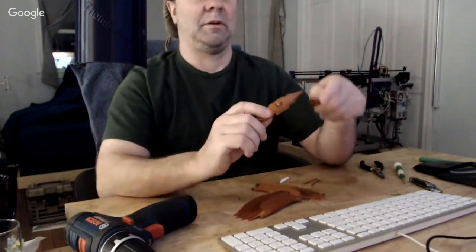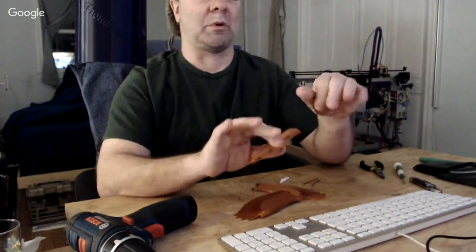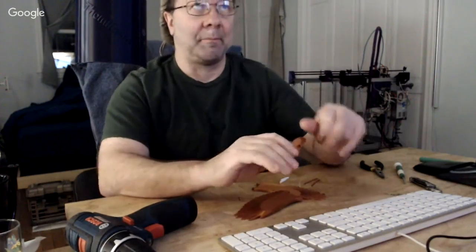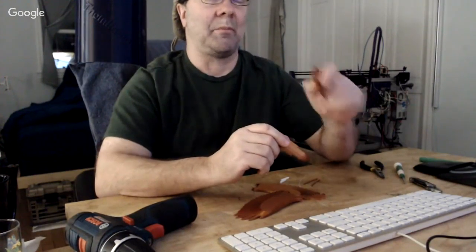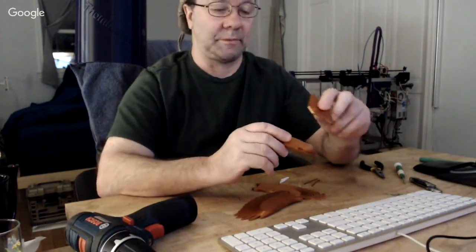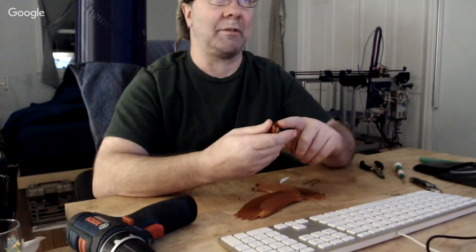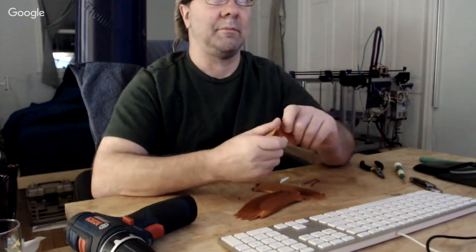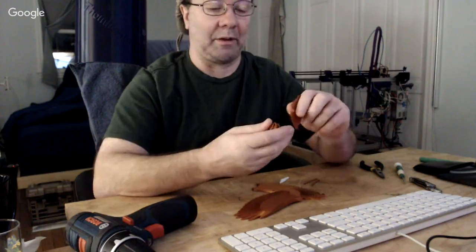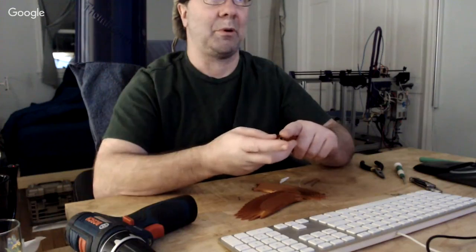The body and tail you want to print lighter. The body is hollow inside — no supports for any of this. I print the tail and the body at two bottom, three top, with 20% infill, no supports. If you can help it, avoid supports in here — it makes it very difficult to get them out. Hawk 3D Proto was having a hard time with supports inside the tube today.